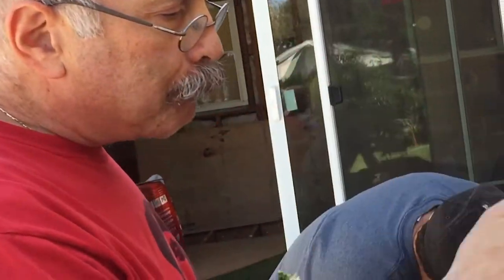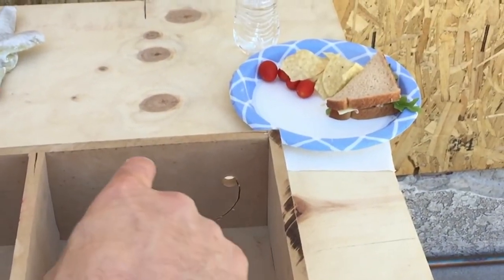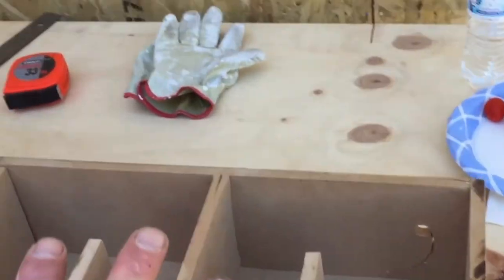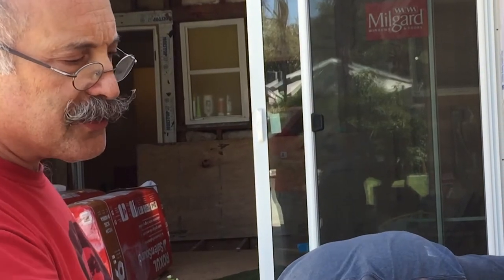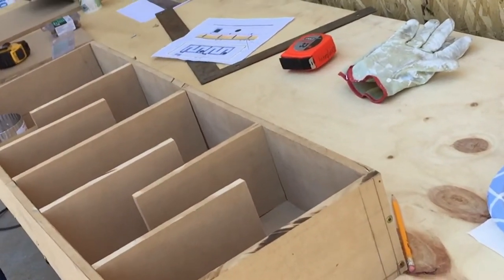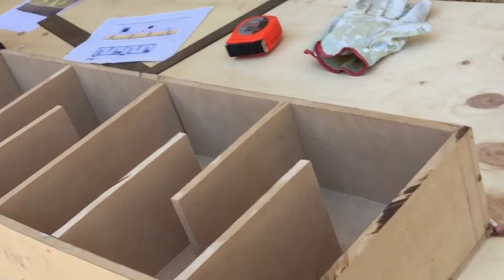So this is the plenum. Dan, tell us about this thing you built while eating your working lunch tuna sandwich. What this is, it's an air flow plenum. Air comes in one way and goes out another. These slats are going to be covered with acoustic foam. Most of the noise you get from air flow is the air flow itself, not actually the motor. We've got a really quiet motor for this, and that allows us to ventilate the entire booth without any extra noise.